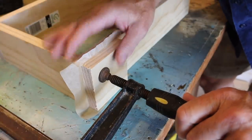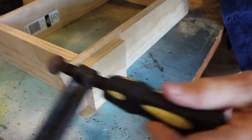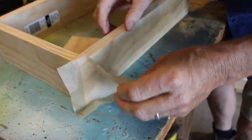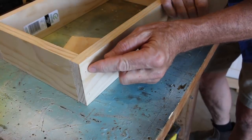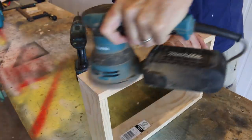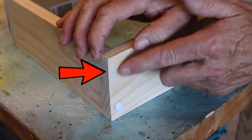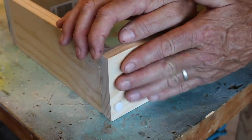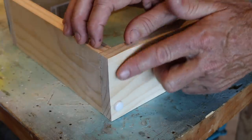Okay folks, this is it — the moment of truth. Let's see how this turned out. Take that clamp off, and now take away the paper. Look at that — there's meant to be a screw there. That is awesome, and it hasn't even been sanded yet. So there you go folks, that's the invisible screw done and dusted. Now all you need to do is either apply a stain or a couple of coats of paint to this, and you won't even know that it's there. Compare that to the screw with the cap on it down here — I think this turned out pretty good.